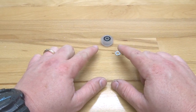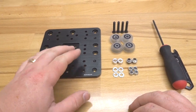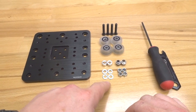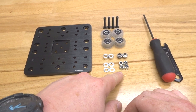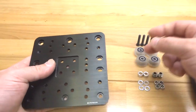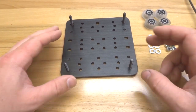These additional parts are going to carry over to our additional steps, so let's go ahead and assemble the remaining seven wheels and move on to the next step. On this step we're going to require our extra large gantry plate, four 27 millimeter screws, four extreme wheels we've already assembled, two six millimeter aluminum spacers, two six millimeter eccentric spacers, four precision shims, and four nylon hex nuts. We'll take our 27 millimeter screws and run them through each one of our corner holes on the extra large plate, then flip it around and start our stack configuration.